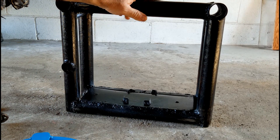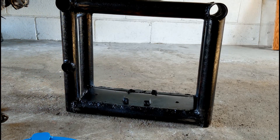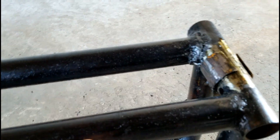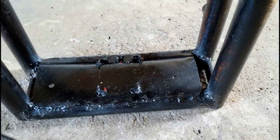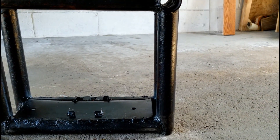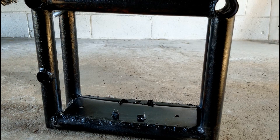This is made out of old scaffolding pipe — I just welded everything together. Right here I greased this bracket so when the pipe or metal bends it'll be a little smoother when it's bending upwards. Here's the base — I put little supports here so the hydraulic bottle jack doesn't move around. The metal plate and all the piping was from old scrap scaffolding. I've got a two-ton hydraulic bottle jack.